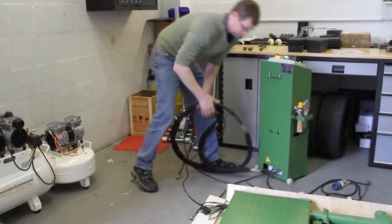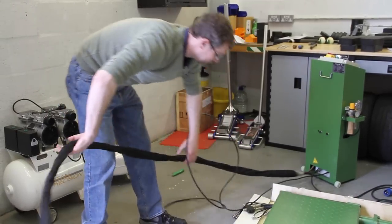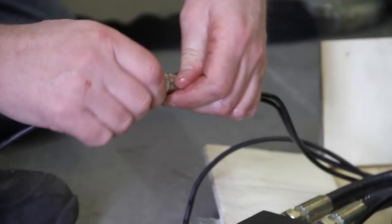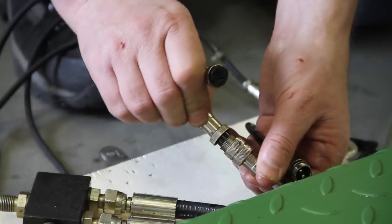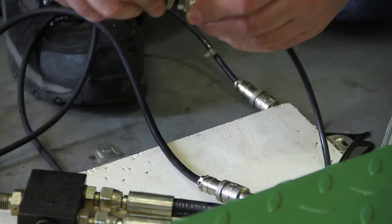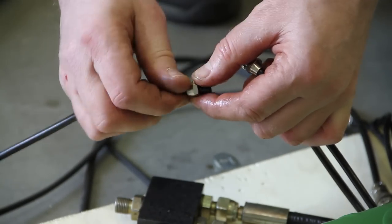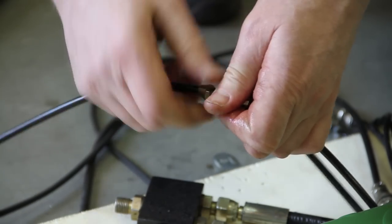This contains the hydraulic hose, three sensor cables and an air line. The first thing to do is to attach the sensor cables. You'll note that there are two three-pin plugs — one of them has been identified by the use of a cable tie. Carefully locate and attach the electrical connections. Now do the same with the six millimetre air line.